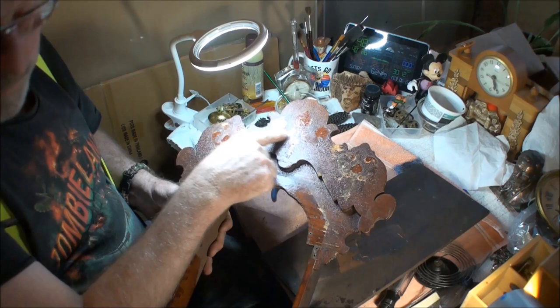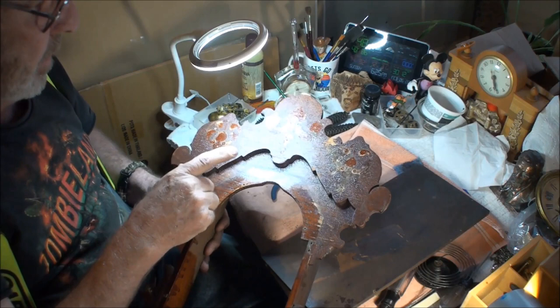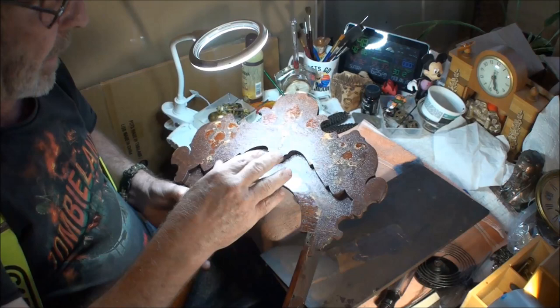But like I say, I'm going to try some of that denatured alcohol and a steel wool and just see what it does to this here. Whether it can help straighten that finish out or what. But just the same, I think I want to strip it all the way down, because someone slopped something on here and get it back to a nice fine finish. Because this is messy and we're gonna fight off the rain, I hope. Anyway, let's get into this.